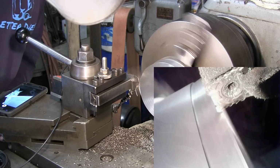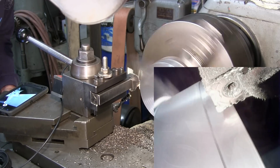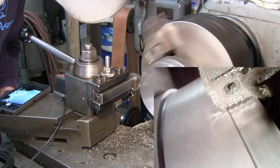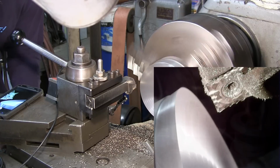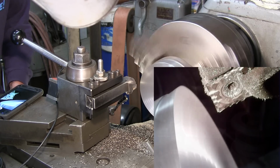Okay, we'll come into right about there's our 100. We'll retouch off back here. It was close, but it did change the dial setting here, so I'm retouching it now because we know we're right at six inches there. This is a 50 thousandths cut now. And it did pick it up.